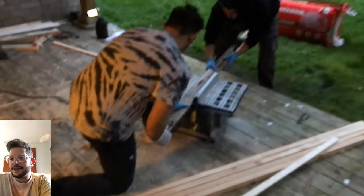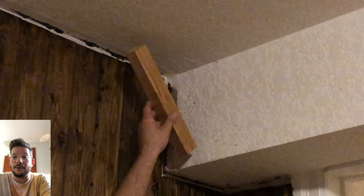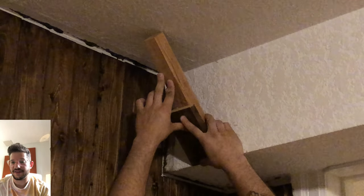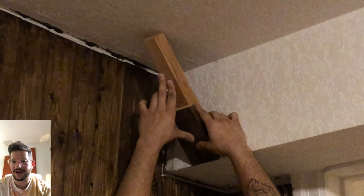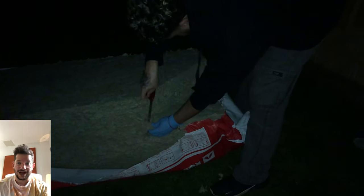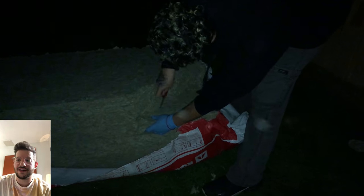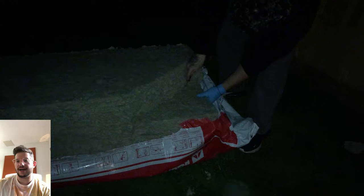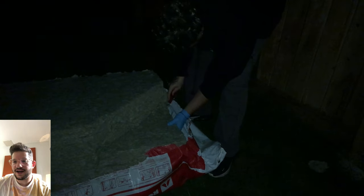Going ahead getting some trim pieces cut on the table saw in advance with Christian so he can stain those 45-degree end pieces and apply the clear coat — that way when we are ready for trim, everything's good to go. Here is the very rear bulkhead bass trap frame. Since we are using the corner as the rear side, you can see how that trim piece is going to meet up nicely with the bottom edge of the bulkhead and same on the top edge. These frames only need to be rectangular, so once we found out the exact size we need, I'm going ahead and getting those bass trap frames cut and screwed together while Christian is getting the Rockwool Safe and Sound cut into triangular shapes so we can stack it inside the bass trap cavities.